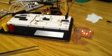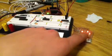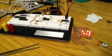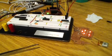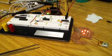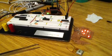But oh well. So the hole in the middle is for this battery, and the battery fits in right here and is connected to 2 terminals on the board. Now, this board does not have a 3.7 volt voltage regulator, which would allow higher voltage charging of the watch. And so this watch has to be charged using a hobby RC charger, like the one that was used to charge the helicopter that this battery came from.